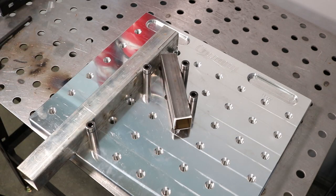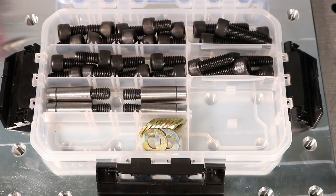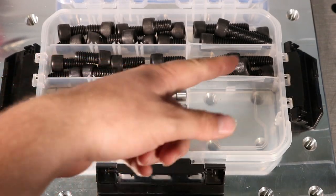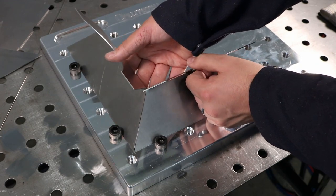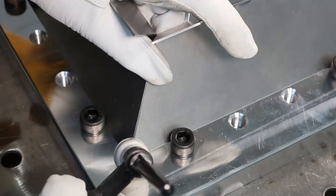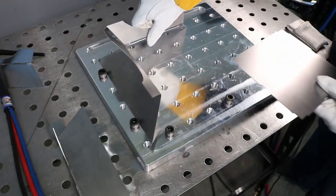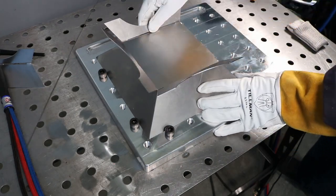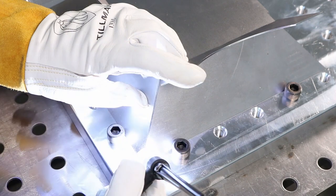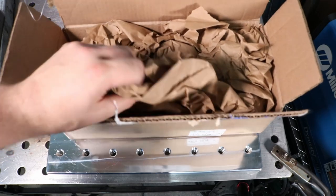While I was at the hardware store picking up those shoulder bolts, I picked up a variety of 1/2-13 fasteners. These can be handy for a number of things — whether it's just bolting down a piece of material or using them as stops on a sheet metal job. Something as simple as having cap screws as stops here on a little mini fire pit I made — you can get everything lined up in place with a nice flat reference surface and two datums defined with the cap screws.